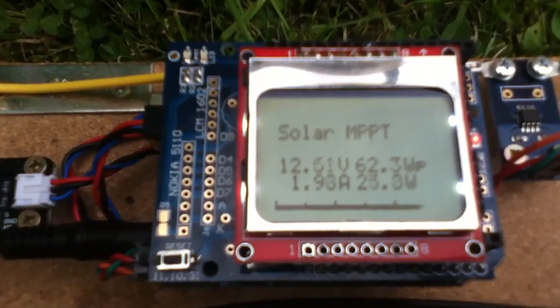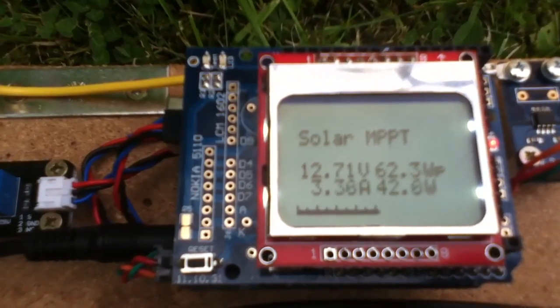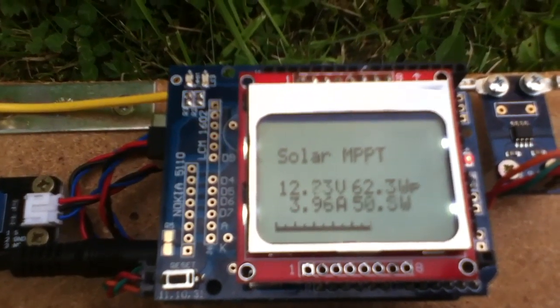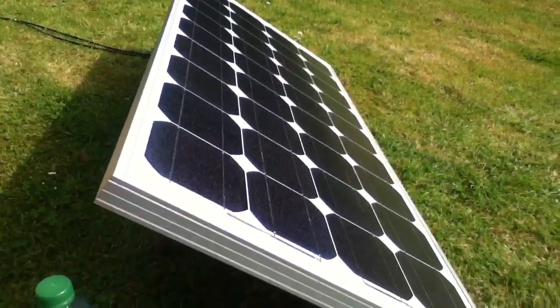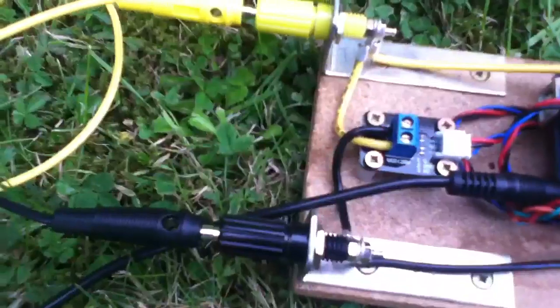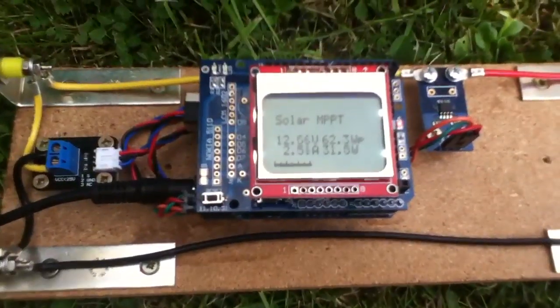So that's reading 23 watts, up it goes, and then the bar graph jumps into that different range, and now it's gone up to 55, 50 watts there. Incidentally, I haven't shown you this — there's an 80 watt panel connected to it this time, and the wires come around there, MC4 connectors are there, and those go into the Solar MPPT as it's now called.